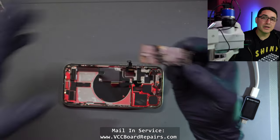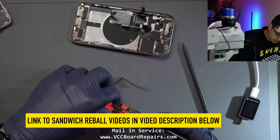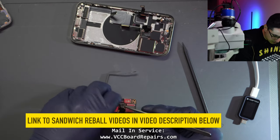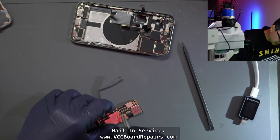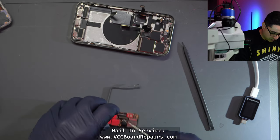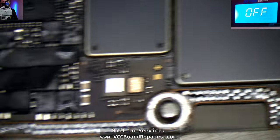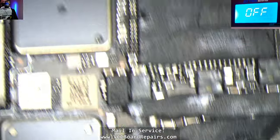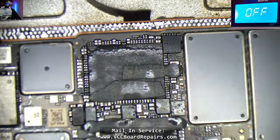We also have to reball it — I'm not going to cover that in this video because I already have reballing videos on my channel. Not just reballing but how to split it and all that. In this video I'm going to skip that step as well just to reduce the length. So I split the board — this is the customer's original board. I used 215 on the sandwich heater — this is the I2C T20 heater and the 15 plates. I don't see any solder balls, so I think we should still be good.